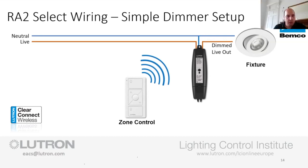Yeah, so the dimmer's got some intelligence built into it. If you short it, it cuts the power going out to the load, and it flashes red. Same thing happens with an overcurrent as well. So the dimmer will tell you quite quickly if it's not happy with what it's doing, but obviously on this, the breaker is a part of it as well. So you just need to be cautious from that side of things.